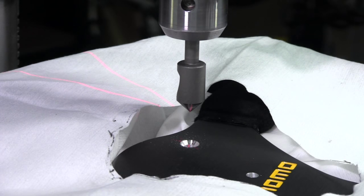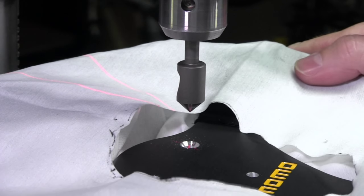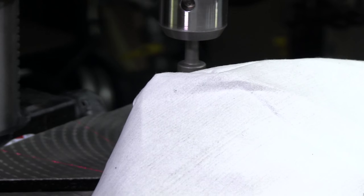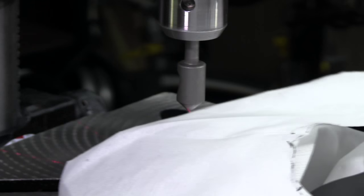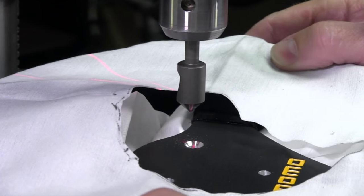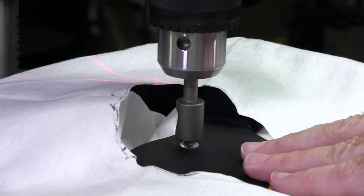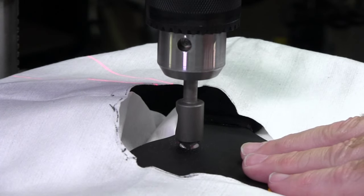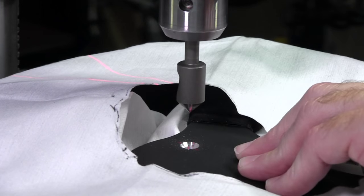All right, we're back at the drill press, and we've cut a little bit of a countersink into the hole already. It's kind of like a pilot countersink, if you will, just to see how the bit is cutting. And I'll take this off and I'll look at it and make sure it's centered. I'll look straight down on the hole and make sure this countersink bevel looks centered on the hole. And I'll put it back in, line it back up, and you can actually use the bit to help you line it back up when you put it back in, so it's not that hard. Or I can move it around a little bit if the bevel is cutting more on one side than the other and I can adjust for it.